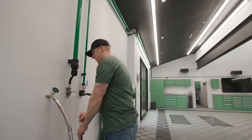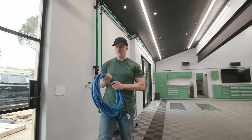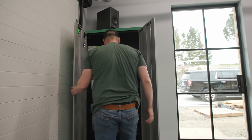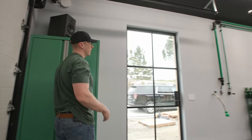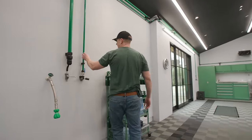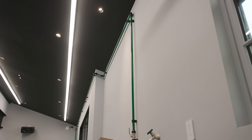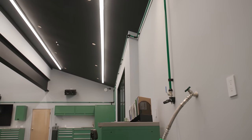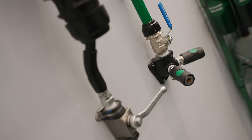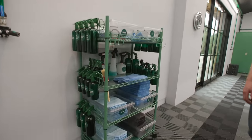It's easy and clean. This was largely Fred's idea. I'd usually put hose reels everywhere, but it's really clean that you can just pop on and go. We also ran one-inch lines. One-inch isn't necessary for a consumer garage, but I think it's the right size — the best-looking version for this scale of line. We used all Prevost S1 couplers and adopted the European standard.